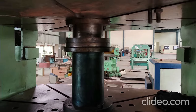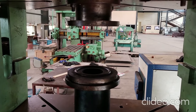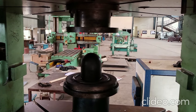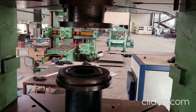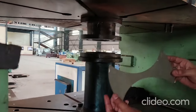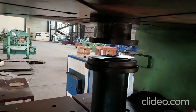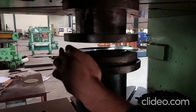This is the 100 ton hydraulic press which is going to be used for the stretching operation. The bottom component is the die and there is a draw bead projection, and the punch comes from below. The uppermost component is the blank holder. There are two actions here: the blank holder comes and holds the sheet, and then the die punch comes from the bottom.